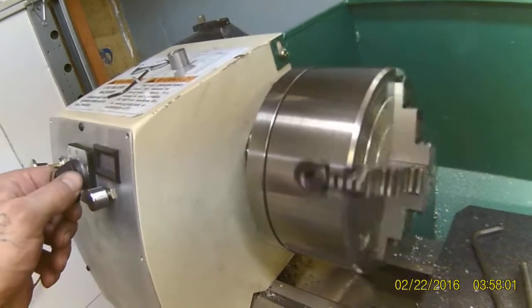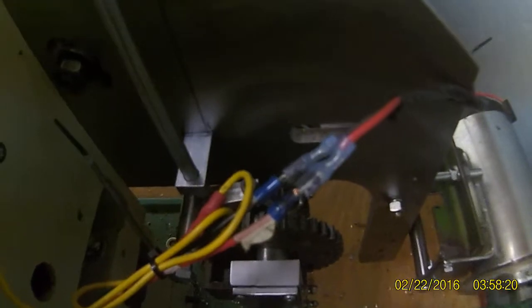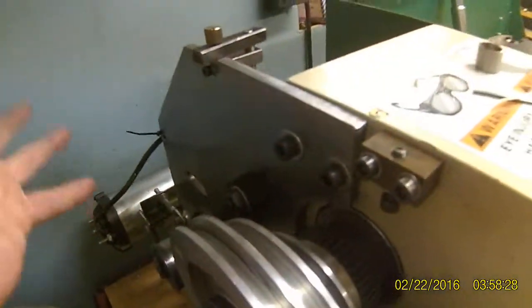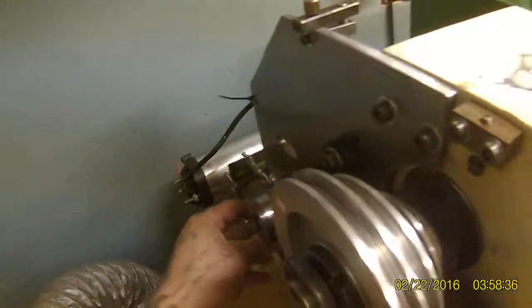What I'm going to do is rebuild it properly. These gears came out of a lawnmower transaxle — I have another one that's a hydrostatic and I'll check what gears it has. If not, I'll find another regular transaxle and build a good one while this one's still in use. The other issue was I had to take everything off my lathe to do this, so if I needed to bore out a pulley it had to be done on a rotary table in the milling machine, which wasn't much fun.